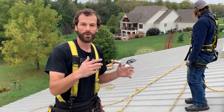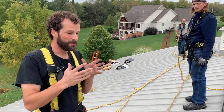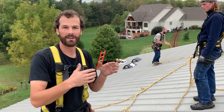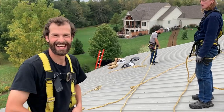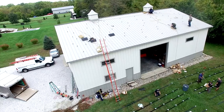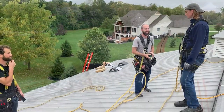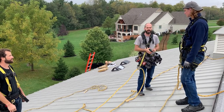Right now we're doing a roof layout. We know the dimensions and the outside dimensions of the array — we've done the simulation and know our max span and max cantilever. Visual center, guys — don't forget the visual center. We are finding the visual center of the roof. The visual center of this roof is the center between the cupolas. We're going to take all of our measurements off of that center mark, and that's going to allow the array to look aesthetically pleasing and balanced on the rooftop.